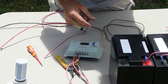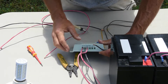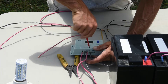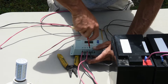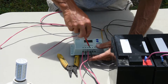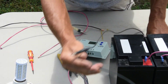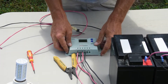Just make sure you don't let the positive or negative side touch each other. Then we'll go to the other side — this is the battery negative, so we'll hook the negative in. Another thing I recommend is always using black and red wire: red for positive, black for negative. If you don't have red wire, get some red electrical tape — put it on black wire so you'll always know just by looking at it that that's the positive side. I'll just use a quick alligator clip for the negative. So we have our battery hooked up.